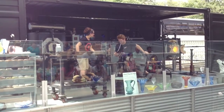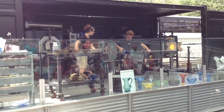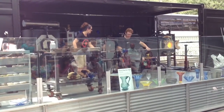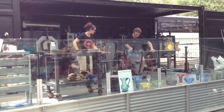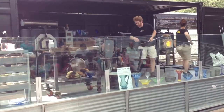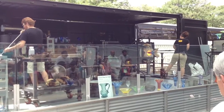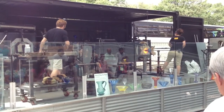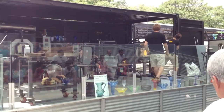I'm good. And then we'll go back to that constriction line, a file to create some score marks or scratches along that line, further weakening the glass, a drop of water, a light tap, the piece breaks free, the crack travels right around that line, right where we wanted it. I immediately begin turning. I want to keep things running nice and on center for Dane.